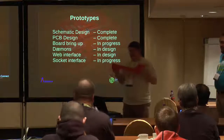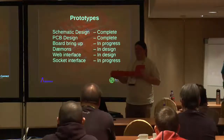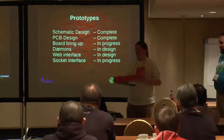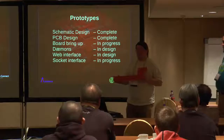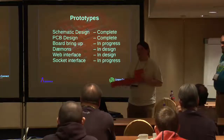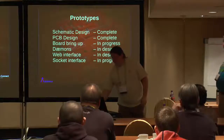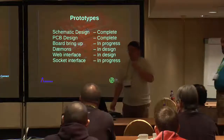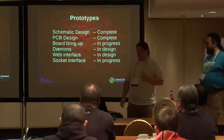I think I'll get the first 2 boards assembled, do the smoke test, do initial board bring up, make sure nothing goes hideously wrong, and I'll pass it out to a subcontractor to get the rest of the boards built. Put a stencil together, yep, and get somebody else to build them on a machine, because to be honest, you need a binocular scope and I haven't got one.